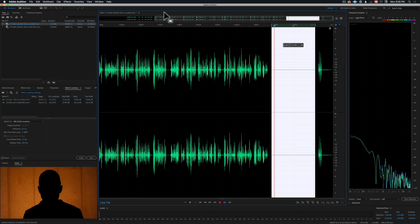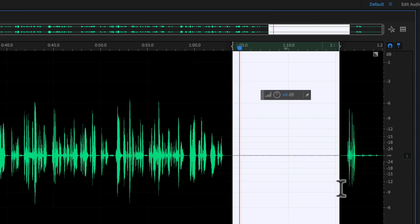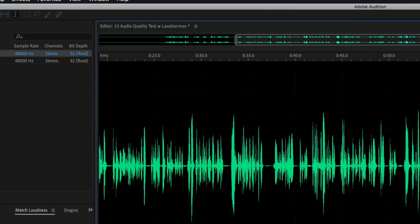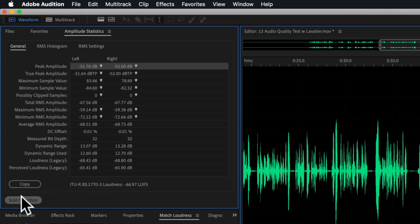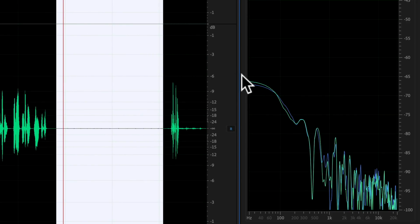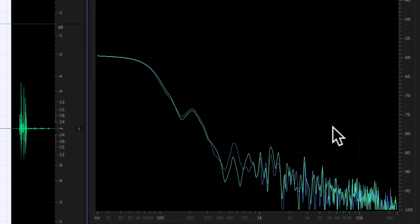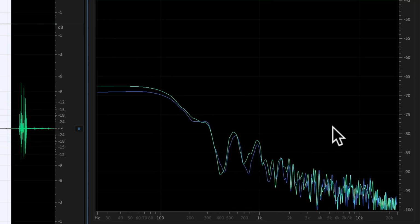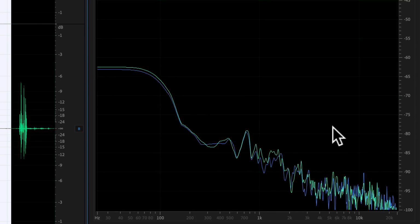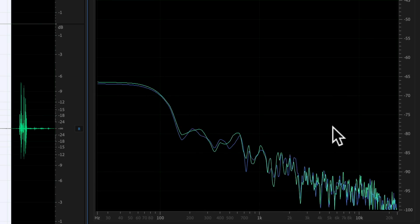In our practical noise test, we recorded in my basement studio. We recorded the dialogue, and then I loudness normalized the overall audio clip to -23 LUFS, and then I measured the silent portion. With the included lavalier microphone, we had a very nice low noise floor, and if you added a high-pass filter, you could probably claim another 3 decibels. And that actually is really, really good. We ended up in the -71 dB range. Generally, I'm aiming for at least -62, preferably somewhere lower than that.